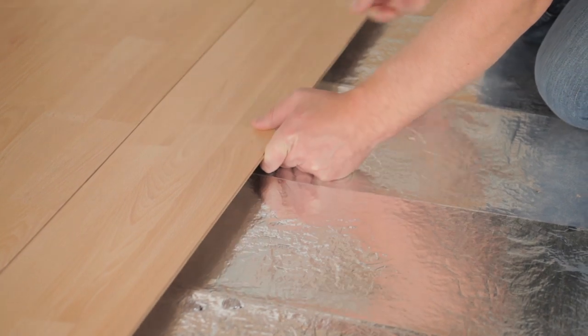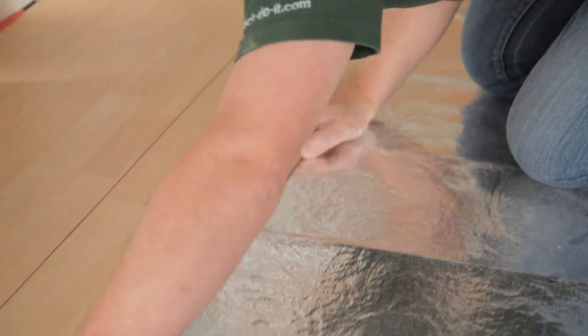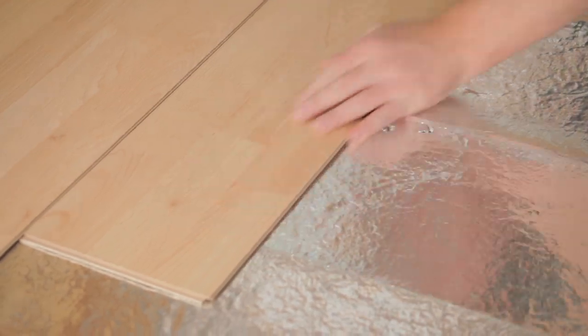What we're doing here is we're laying this on a fresh floor. So after I've finished all my gaps and I've taken my spacers out, I'm actually going to put some caulk in mine to allow for that expansion and contraction. And then my skirting board is going to cover it. But if you're laying to the skirting board, so you haven't taken your skirting board off, so you've left your gap between the skirting board, then you might need to use some sort of bead edging.